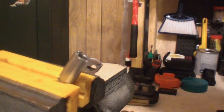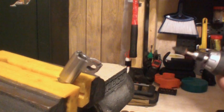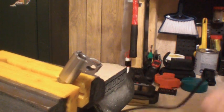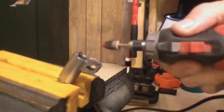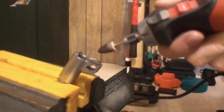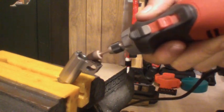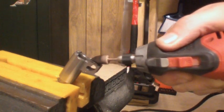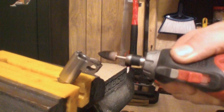We want to make sure it's more reliable for feeding hollow points. I've never had any problems feeding hollow points, but I don't mind the idea of having a more reliable pistol. This is extremely easy — anybody can do it. You're not changing the profile; this has got two profiles on it. You are just polishing it, and you're not going into the barrel — you're not going anywhere but just to the land.